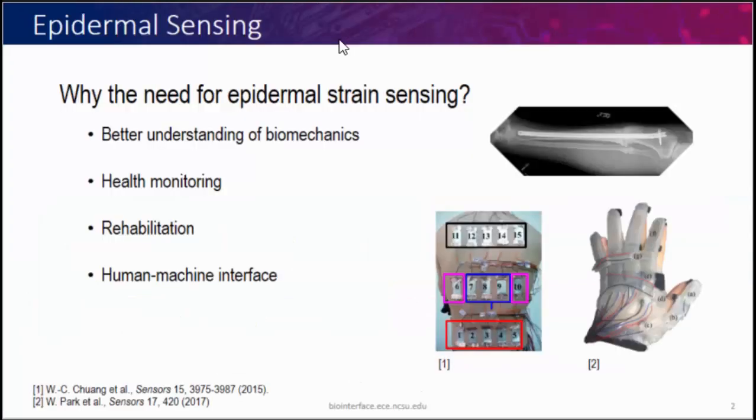So why are we interested in doing sensing on the body? There are actually a lot of benefits for improving quality of life when we do sensing on the body, and this has been realized in the past two decades. An example is fracture fixation hardware, like a tibia rod which you put into a leg when you have a fracture. With improvement, we're putting strain sensors on those devices — they last longer, and you can actually monitor healing of the bone in-situ with the strain sensor without taking x-rays or going to a doctor, just by doing strain measurements.